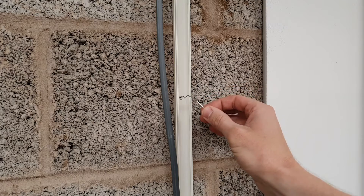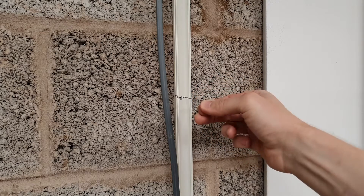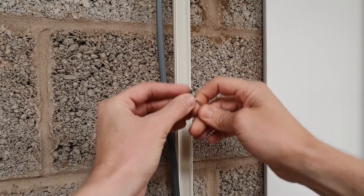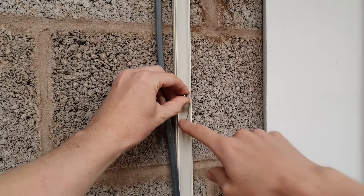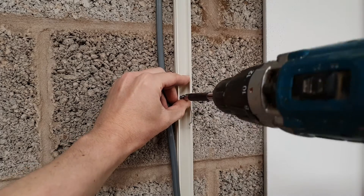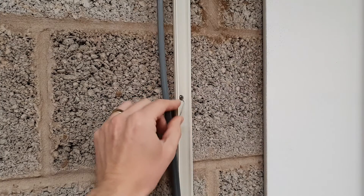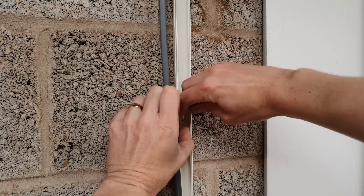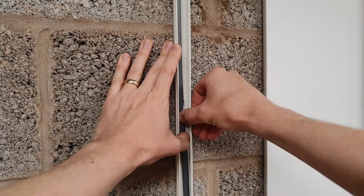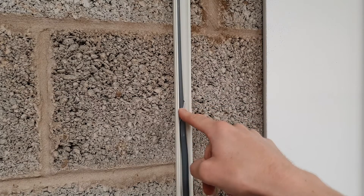Next is the spring clip from D-Line. I quite like the simplicity of this one — it's just a thin piece of wire, really nice and easy to install. We pop the DeWalt Wall Dog through the hole at the end and screw it in until it's nicely bitten into the wall. Then we spin it into the right position, grab the wire, pop the cable underneath it, and let the sprung metal do its job — holding the cable nice and tightly in place. A neat little fire-rated solution.